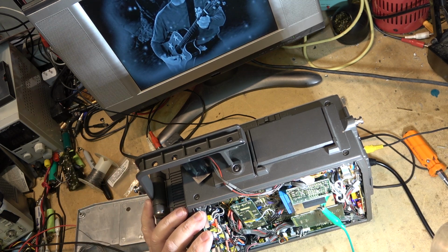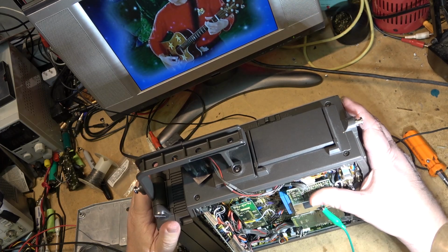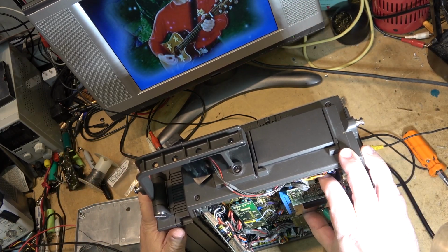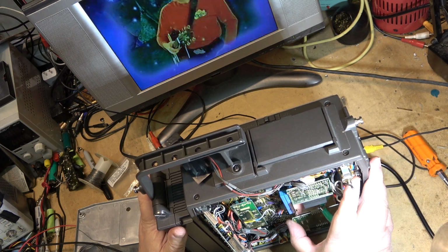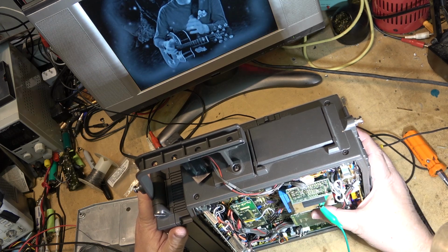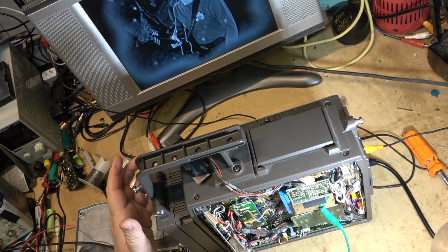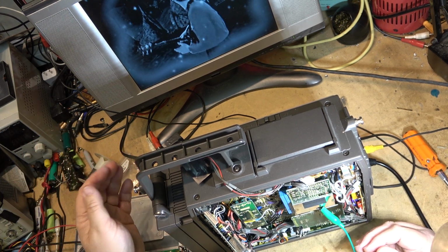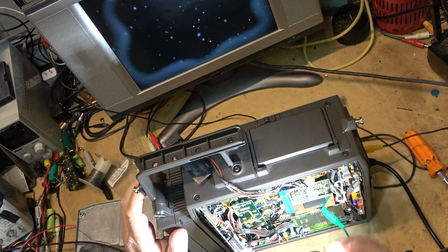because just from the multiple problems it's got with the no color, with the color that's intermittent. See, the color just came back on its own. But just due to the problems that this machine's got, it may not be. Something just loose. I mean, it had a servo problem when I first fired it up. The drum was hunting. You could hear it. That's rectified itself. Again, it's probably other caps that are leaking on this board.